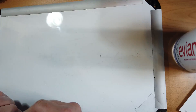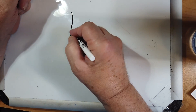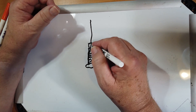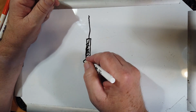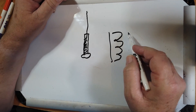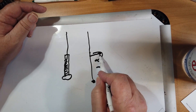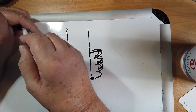Here is what he has done. He has a base, a plate, and on top of this he has a screwdriver antenna. A screwdriver antenna sticks up, has a monster coil in here. The coil rotates, and the tap for the antenna moves up and down this coil. Here is the antenna going up, and it taps here. A motor can turn this, causing this to come around like this until you get to just the right position — just the right amount of loading for that particular frequency.